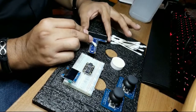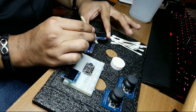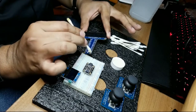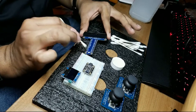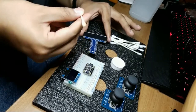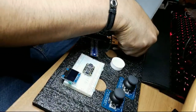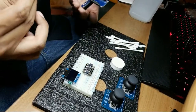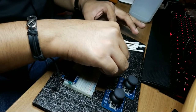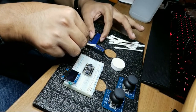I know it's not salsa chip, but salsa chip container for the chips. But I like pouring alcohol into that cap just because it's already there. And when I use this alcohol again, I want it to be clean, right? You don't want to have flux floating around in there. So at this point, we throw this away into the garbage adjacent to me. One flew out. I'll go for this stuff now. And again, just put cotton area here, and bam. Just try to clean out some of the residue.